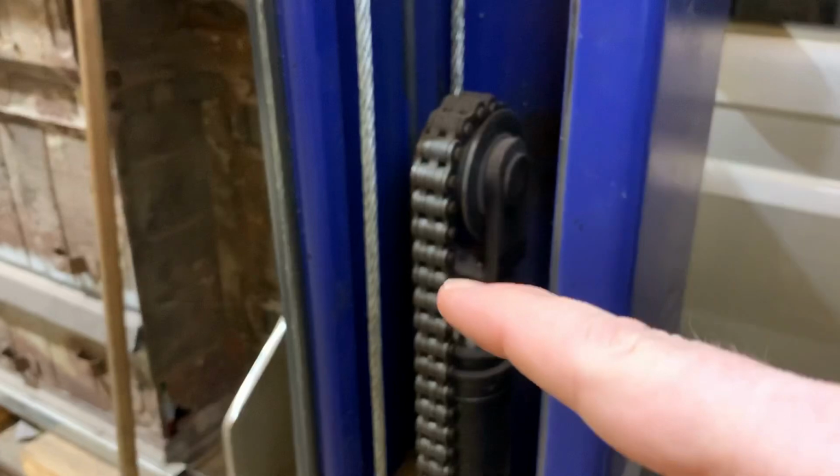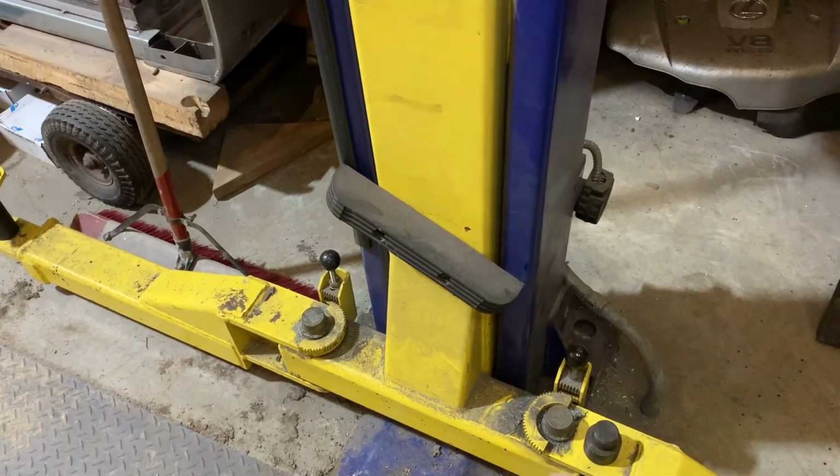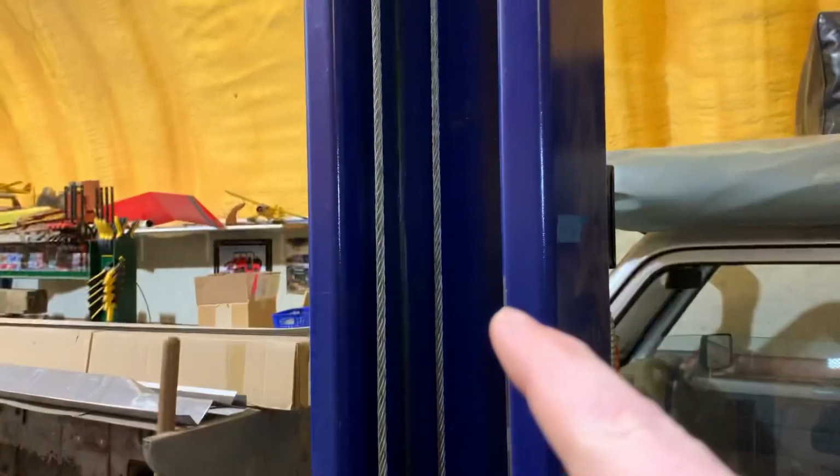If you're having trouble understanding how I'm going to get a 600mm stroke cylinder, or 2 Freedom Unit feet, to lift 4 Freedom Unit feet or 1200mm, let me show you where I got this idea. This bed lift is actually something that I've been struggling with the design of from day one of wanting to do this build. And one day, about a month ago, I looked at my hoist. By wrapping a chain over top of the cylinder and dropping it down to the lowest lift point, we can make this lift all the way up to here.